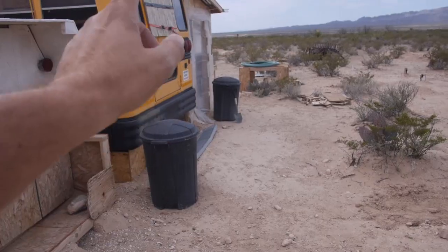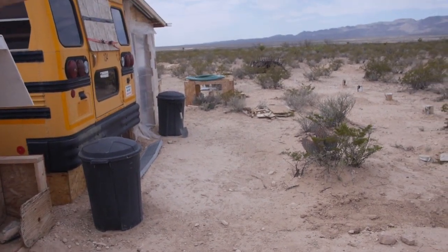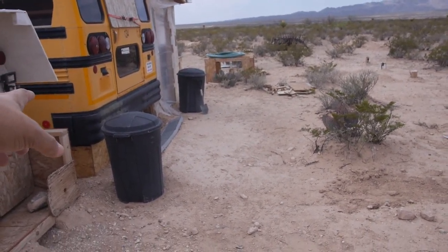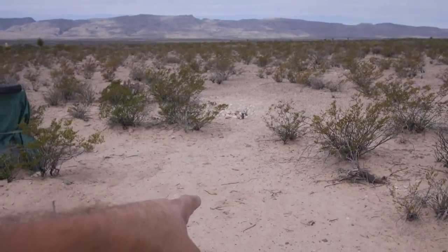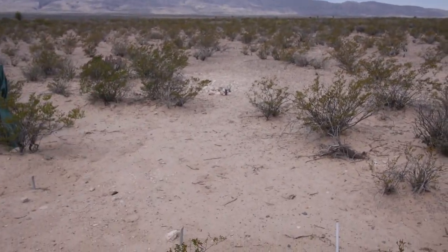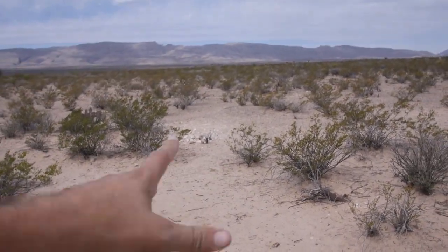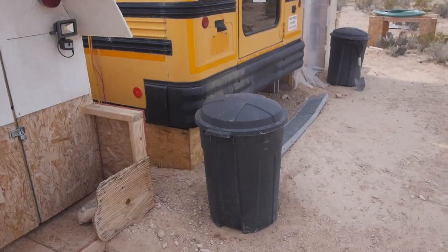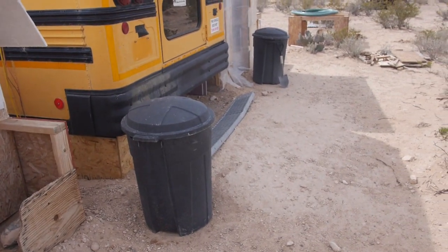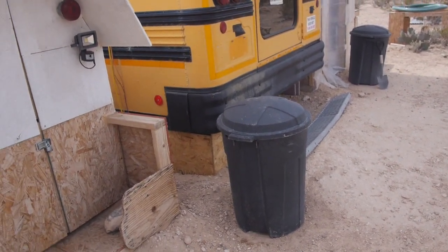Alright. Drop the sump pump into that, pump water up and out through a series of adapters, come out to 1-inch pipe, 3 separate coils of 100 feet each. I'm going to just lay them out here on the ground for now. They'll get hot in the sun and then come back into the trash can. Between 4 and 6 months of the year, I don't really need to heat the water. So I'm kind of just testing this for now.